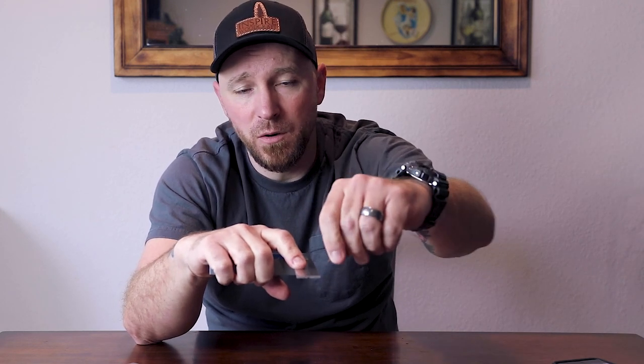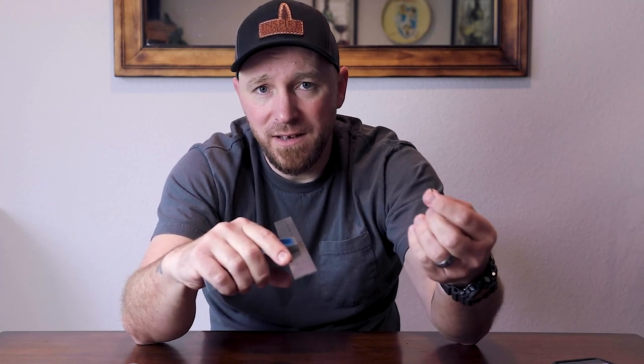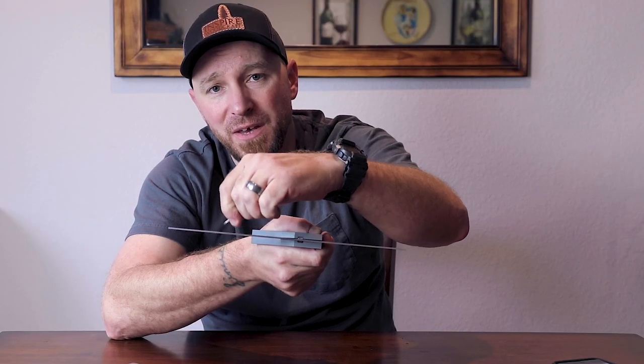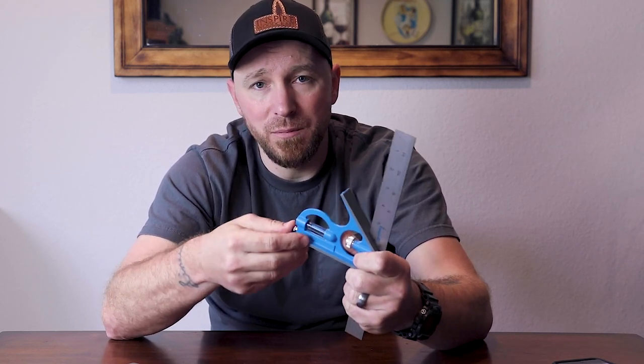When we look at the head itself, on the back there's this little knurled knob looking deal — you pull that out, it's actually a scribe. From what I've seen in older literature, this was more intended for scribing metal, but it works in the wood shop just the same. If you use this to scribe wood, you'll notice two things very quickly: one is that it works really quite well going across the grain, and you'll also notice it doesn't work nearly as well going with the grain. When you go across the grain, the wood has soft spring wood and harder fall wood, and it's a much easier trip across those differences. When you go with the grain, the scribe can get hung up and actually follow the grain itself.